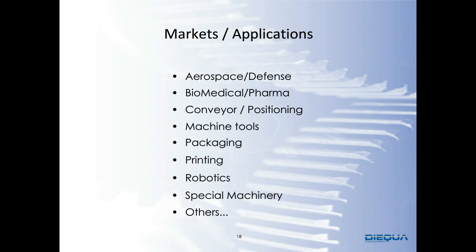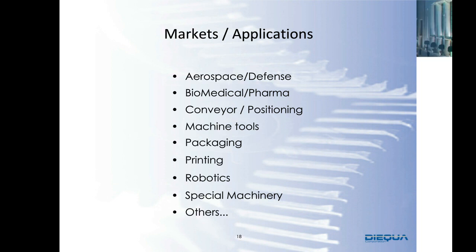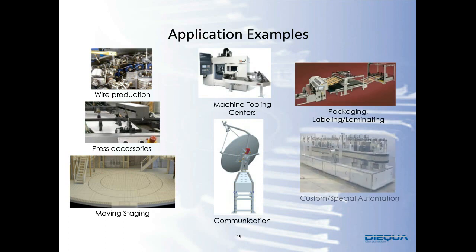When we look at certain applications that also demand the unique capability of providing the option of being non-back driven, in other words, in a vertical application where you might have a belt-driven actuator, it is advantageous to have the ability not to be back-driven. Typically, ratios greater than 30:1 have the capability of being self-locking. Ratios above 50:1 are non-back drivable. So if you're looking to perform a vertical application, here we have the ability to hold the load in position without requiring a brake to be used all the time.